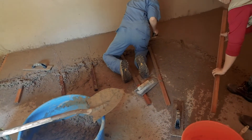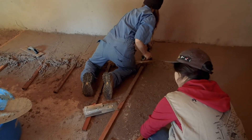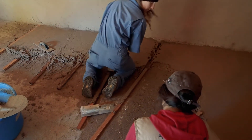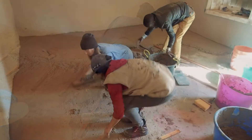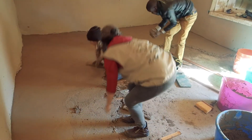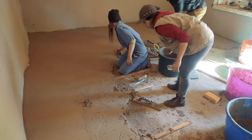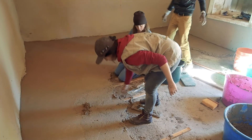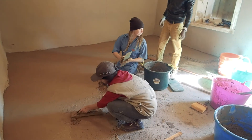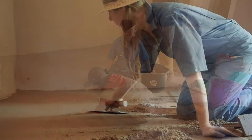For this we mix together the clay, sand, and straw to the perfect consistency, and then we get buckets and wheelbarrows of that and slightly wet the ground. Not so that it's sopping wet, but it's nice to wet it so that it's ready to receive the next layer. And then put a bunch of mud down, and then I use the wood float and press everything down in between the rails to try to make it even.